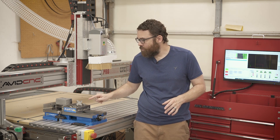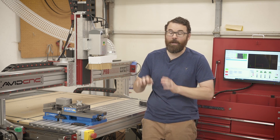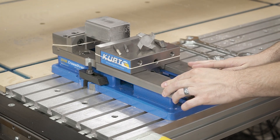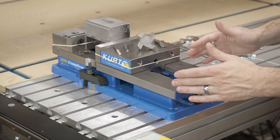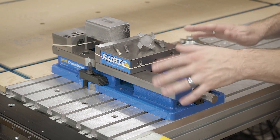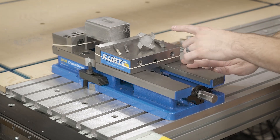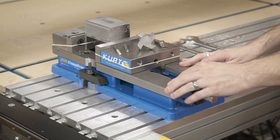The second step is choosing the right tooling that works with the advantages of the CNC router and tries to minimize some of the disadvantages. The biggest advantage of a CNC router is speed — not only the RPM spindle speed but also the travel speed. On a machine like this, I can easily do 500 inches per minute, whereas something like the Tormach maxes out around 100 to 120 inches per minute. On the spindle, we can do 24,000 RPM versus 10,000.